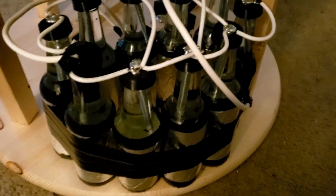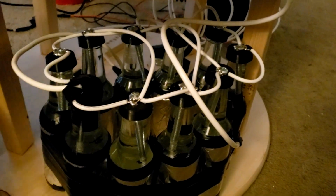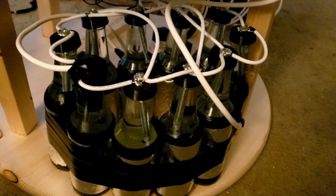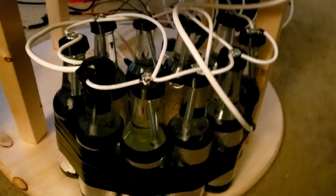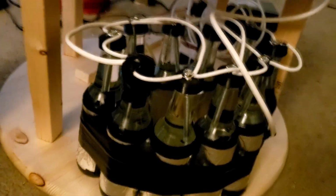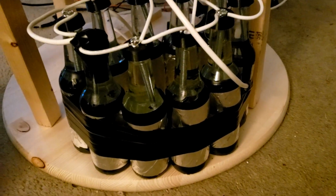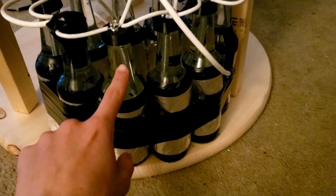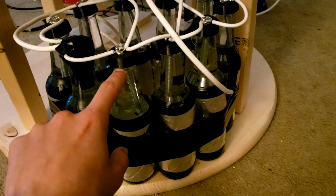There were a few explosions and some other things going on, so it was pretty much trial and error, but I figured out that the plastic in the bottles was just too thin for the high voltage. And so I transferred over to a beer bottle capacitor network. The first problem with this was too much corona discharge. So all of these are filled with salt water up until about here, and then I put mineral oil to the top to prevent that some.